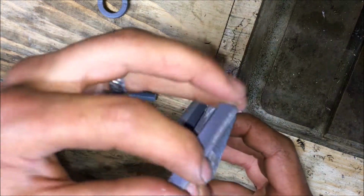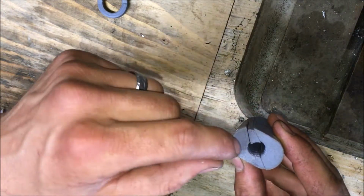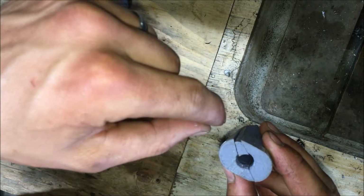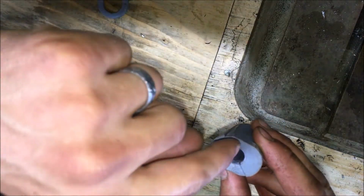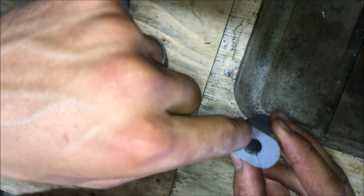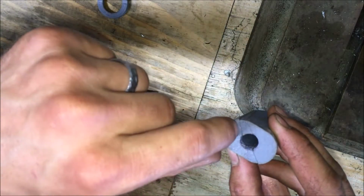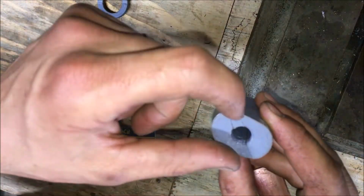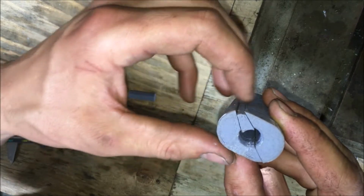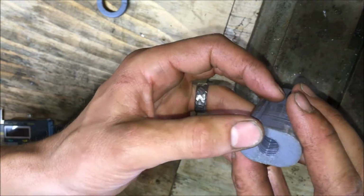So like I said, the goal was to have a self-disassemblable piece here. So the key to that is having this less than 45-degree angle. So right, if you have an XY coordinate, greater than 45. So this guy is like a 50 something degree, 55. This one's about a 50. The idea is that these guys actually want to push it out. So that's why that rod's important. That's why the retaining ring is important.